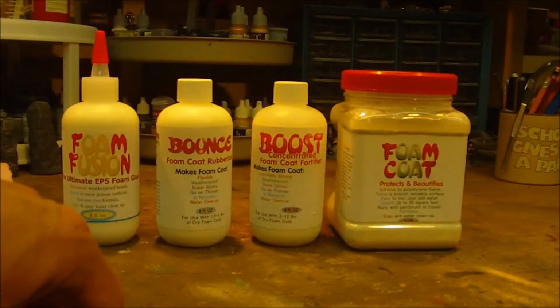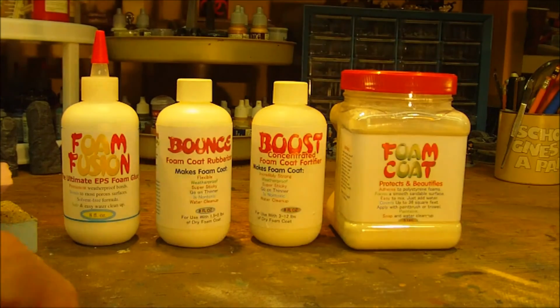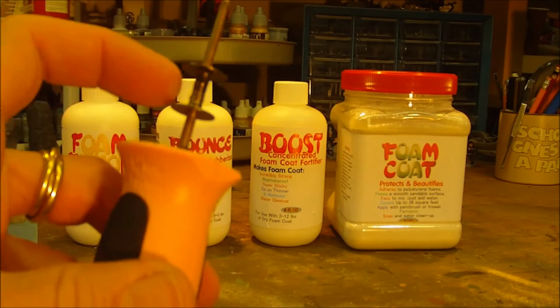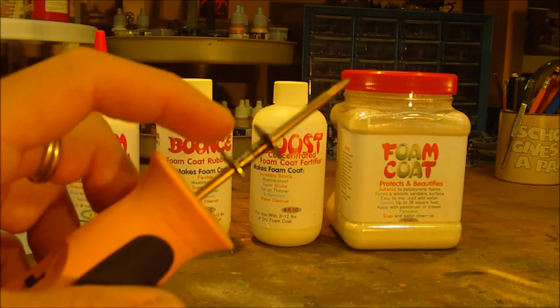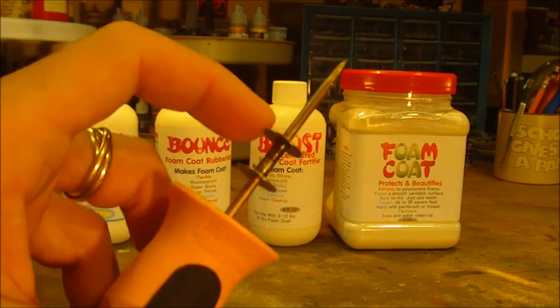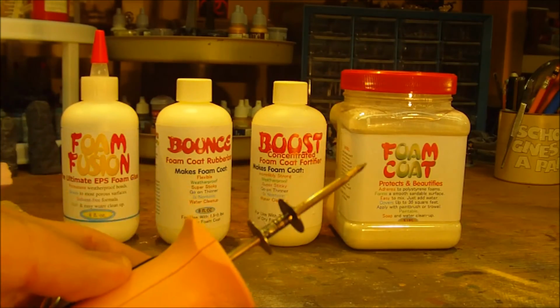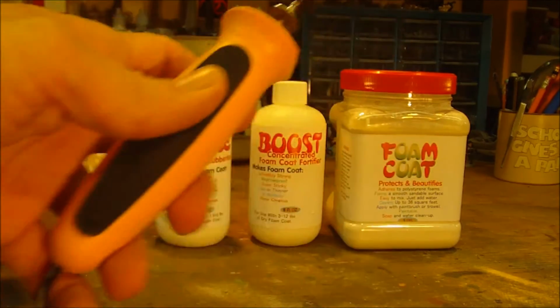Oh, and I almost forgot. All right, hold on, looking under the shelf. Here we go. So here's the hot wire engraving tool. I did finally ask what these flanges were for, and I was right. The flanges are designed to radiate away heat so that as it heats up, it doesn't go into the handle and cause any problems. So it's literally an air-cooled radiator flange to dissipate some of the heat coming back from the tip.